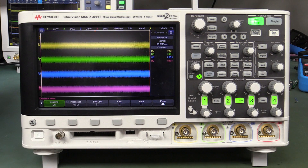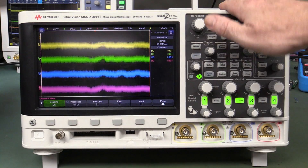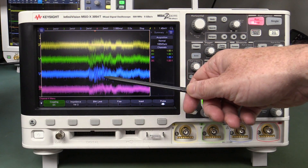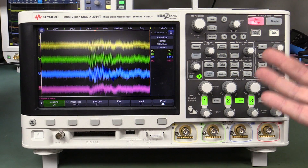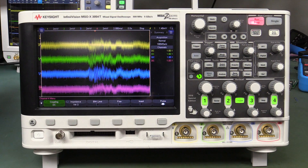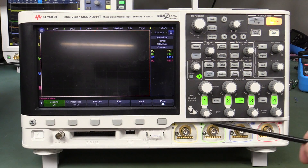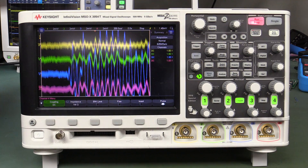Let's have a look at the good old Keysight 3000X series, been around for a long time. Give it a tap on top - it's doing it, there's something there, but you really have to hit it hard. It's certainly possible, but it's much higher frequency content than what we were getting on the Rohde & Schwarz ones. That's going to be totally dependent on the construction of the MLCCs - it's all to do with mechanical resonant modes of the piezoelectric material and the plate size. One channel did couple through to channels 1 and 2 there.